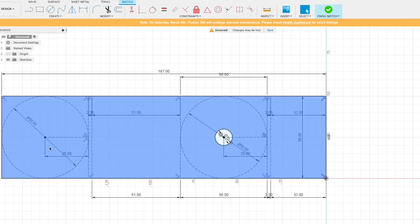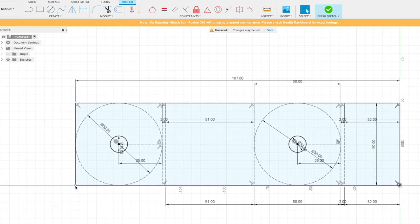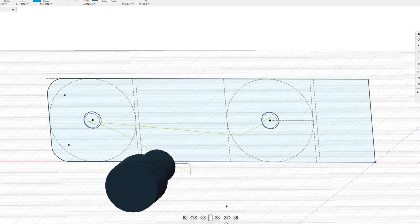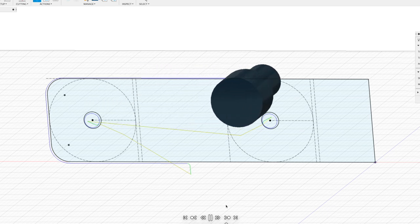This is version 1 of my wheel mounting system. I don't expect it to be correct, but I want to get to the point where I have a piece in my hand and I can check actual clearances. The previous screen was the design environment; now I'm in the manufacture environment, and I'm simulating the tool path that my plasma cutter head will take.